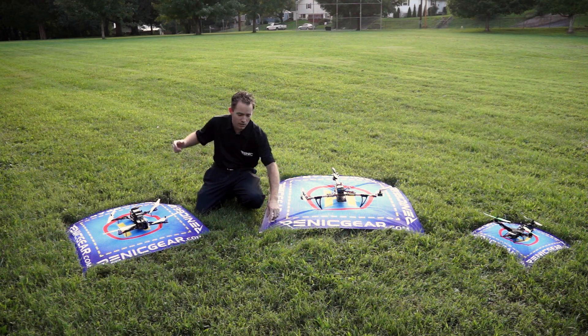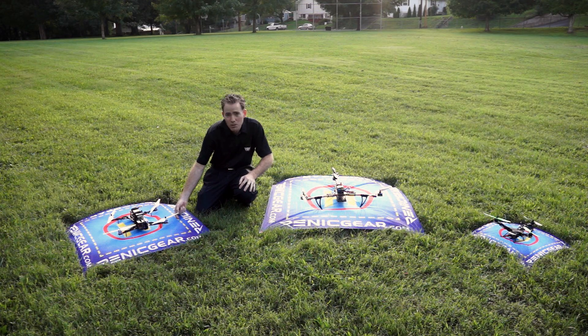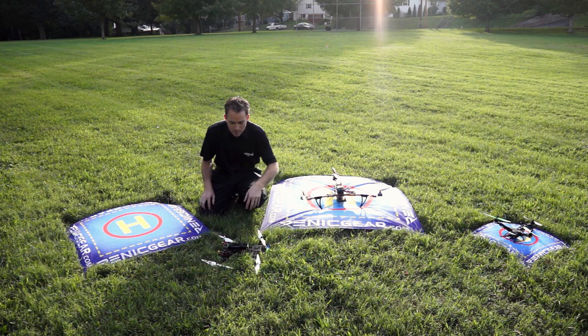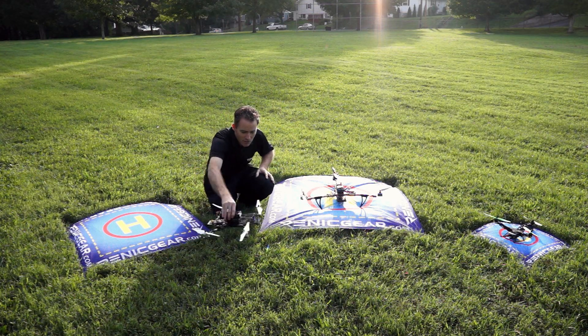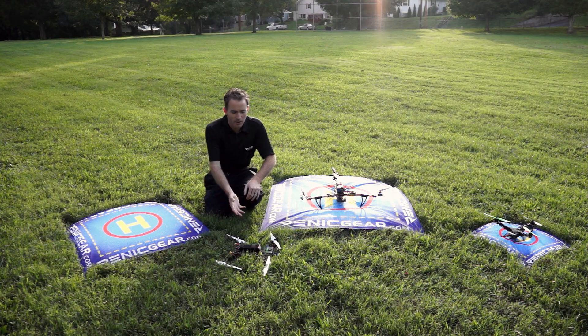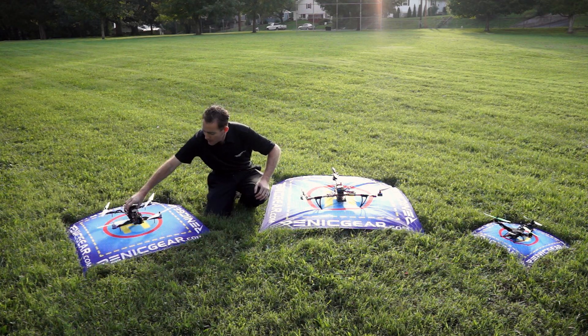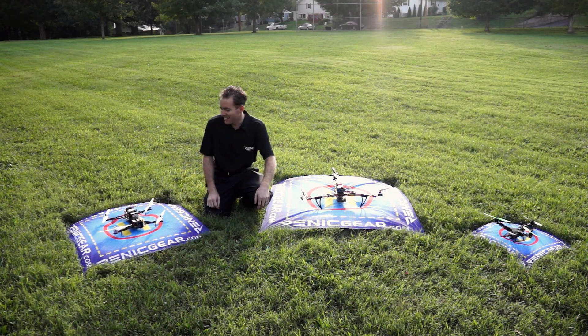I have it held down with some cheap Walmart tent posts, gotten as tight as possible so it had no chance of moving. This is the one we'll be taking off from — you can see I roughly have two inches of clearance from the pad at the highest point to the prop. If I set the same thing down in the grass, the props are about two inches below the level of the grass. You have to think that when it starts, it's going to move a little bit and settle down in the grass even further. There's no possible way to take this off in the grass right now. But if we take it over and set it on the helipad, now you can take off, and you're not going to have green props like this does right now.